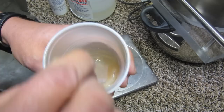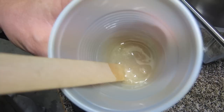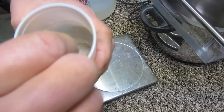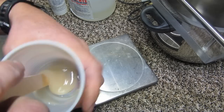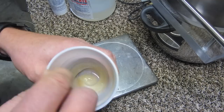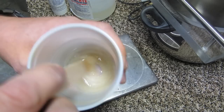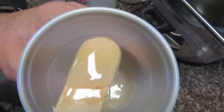There are plenty of videos out there showing how to mix epoxy. I'm going to do two things that are considered no-nos: one is I'm going to whip this like I'm making whipped cream, throwing in lots and lots of bubbles — it's almost all bubbles. I'm also not going to use two canisters. Most people agree you mix it in one container then transfer everything to a secondary container. There's nothing wrong with that, but there is something wrong with stirring this fast with this thick an epoxy — it's a nasty mess.